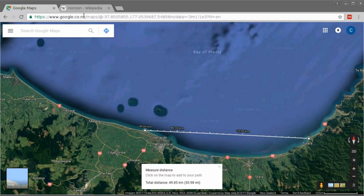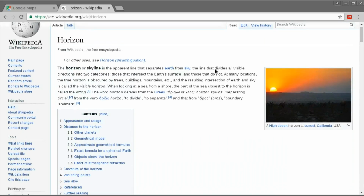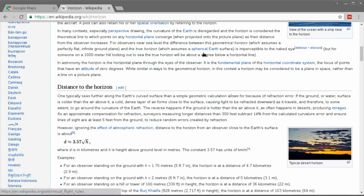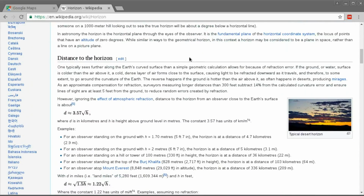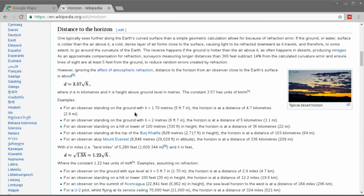But there's one other thing that we need to take into consideration. We're starting to bump up against this problem where the curvature of the Earth means that the beam of the antenna is not even going to be visible at these distances anyway, unless we get a pretty good bit of elevation to transmit from. And there's some examples shown here. There's a pretty easy formula that can work out how high you need to be to see over the curvature of the Earth at certain distances. So this is what I was doing today: roughly 36 kilometers, you need 100 meters of height.